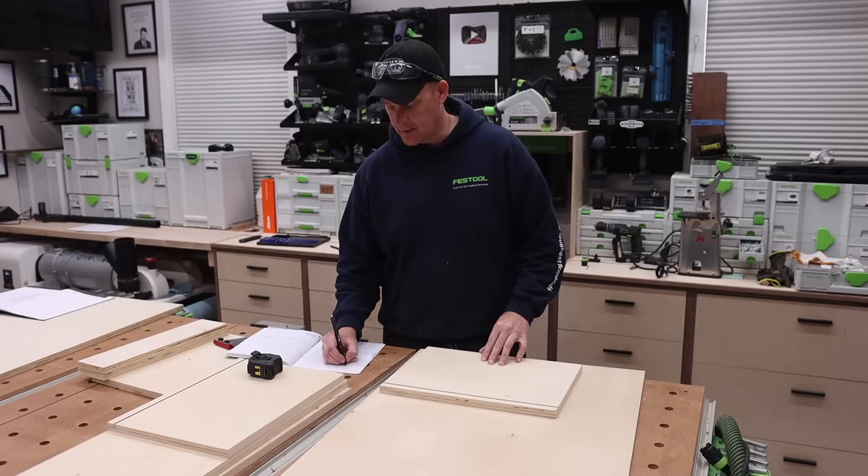Now I have my pre-drilled hole locations for the plate. I'll go ahead and put the hinge plate on the inside of the cabinet. I like to start with one screw and not tighten it all the way, then take the second screw — still want a little movement. These are self-centering, so you'll see it adjust slightly. Not quite all the way tight yet. The orientation: these rest on a little bar on the backside of the hinge, and the little hole actually goes towards the inside of the cabinet — just an easy reference. If you make jigs because you use a lot of the same hardware, it's an easy reference for the future.